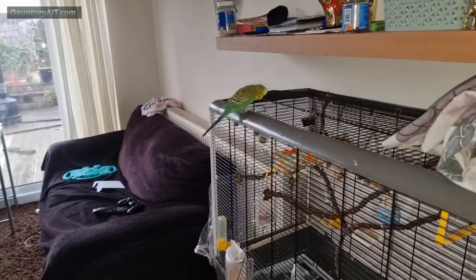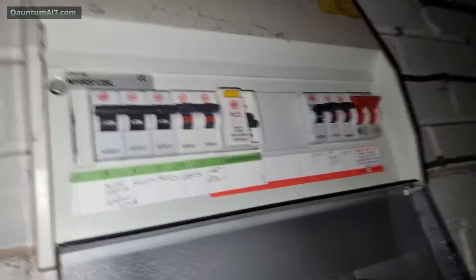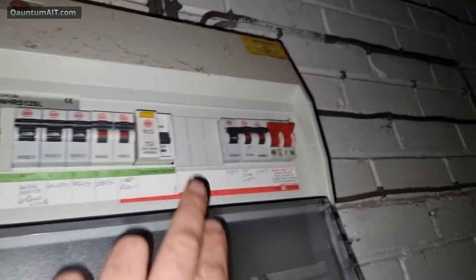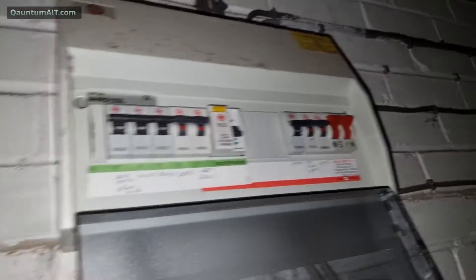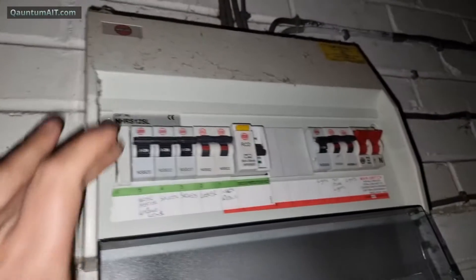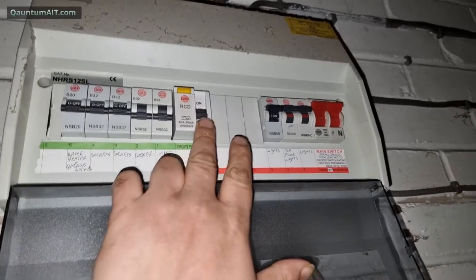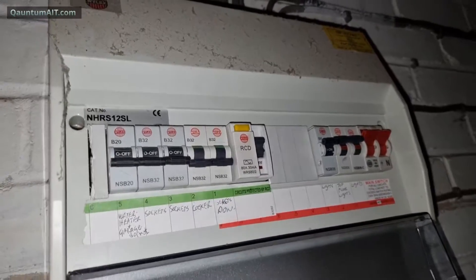The budgies are still on. Okay so what you do - you go to the fuse box and you look what's tripped in there. The RCD's tripped. Try and put the RCD on - it won't go on. So everything's off. What you do next is you pull everything down and see what's tripping. Fingers crossed the RCD should come on - if not you've got a bigger problem. Okay, the RCD's on.